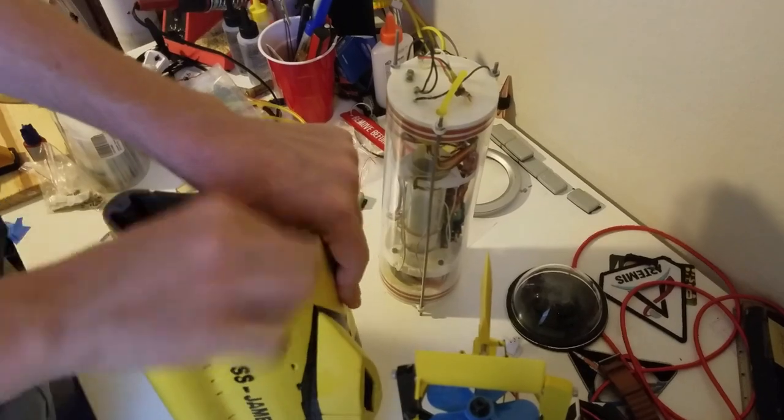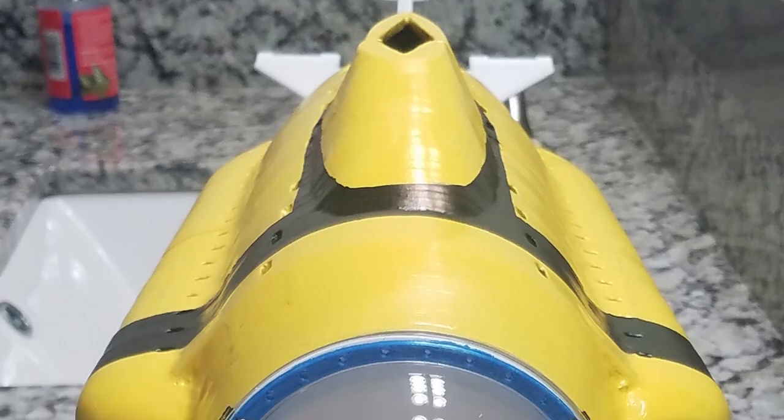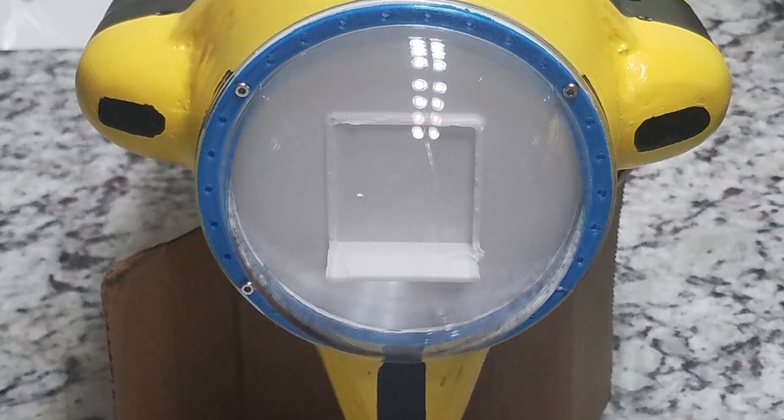One of the final steps is trimming the submarine. So the bags of gravel I had used earlier actually came in really handy here. I was able to weigh them, record their weight that they add to the cylinder, and then use that weight to determine an amount of lead weight that goes inside the sub.